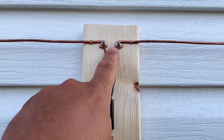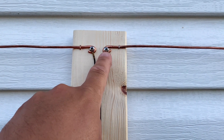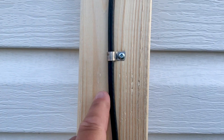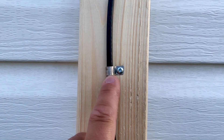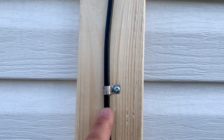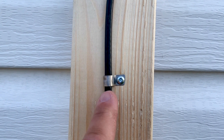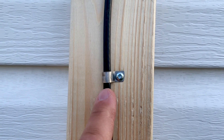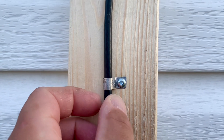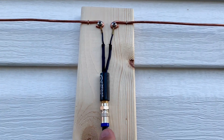It's important to have a space between your elements — about a half an inch. These should not touch. If they touch, you're going to short out your signal and you won't get any TV channels. I also used a couple of straps and a plastic staple to keep the coax cable in place. Some people might say this is not a good idea because it could crush the dielectric insulation in the coaxial cable, and it is a little snug, but there's a little bit of wiggle room. I just didn't want this cable pulling on the transformer wires and breaking them.